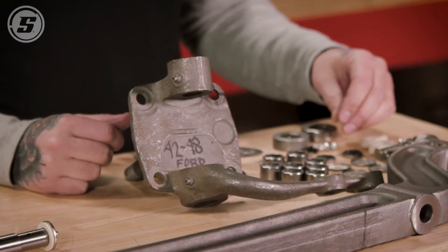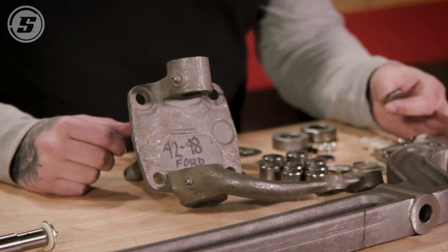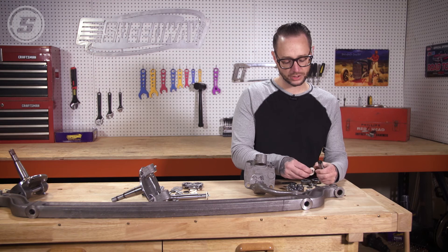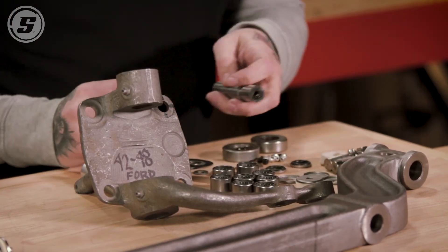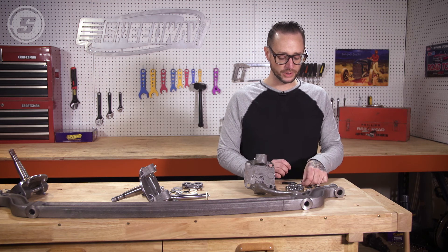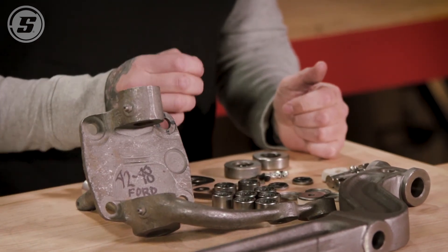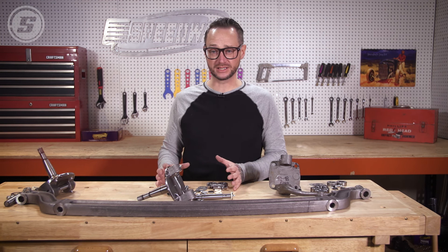The only real difference with the 42 to 48 is that you are almost always going to have the smaller cap on the bottom with the o-ring. And let's say you get it nearly done, you have your cap and felt washer on and you put the grease zerk in to lock that cap, and the grease zerk bottoms out before you're tight to the cap — we also include little washers in the kit to make up that difference. If you bottom out and the cap's a little loose, go ahead and add a washer or two until you get it tight and the grease zerk is installed properly.